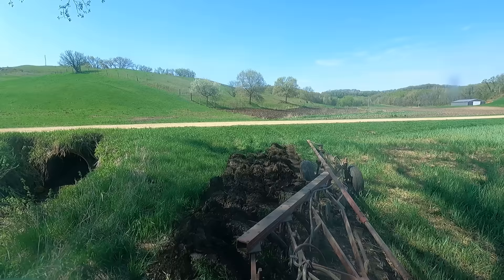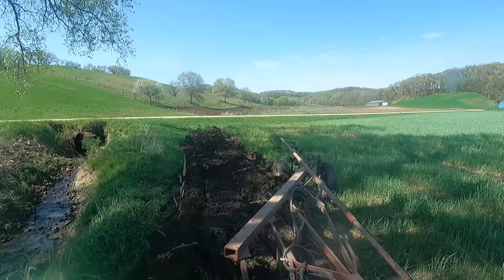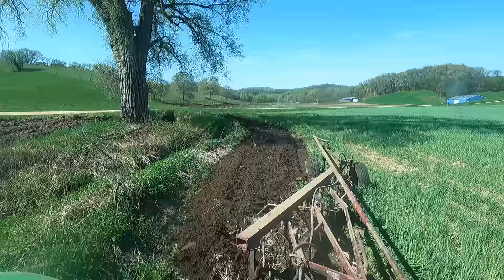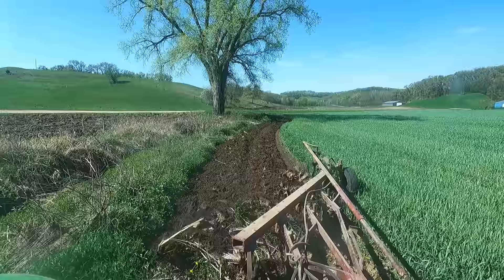On the first pass we've got to set the front part a little lower on the three-point, being that the wheel that would normally go down in a furrow is not in the furrow yet until the furrow is there. You don't want to move too fast because you don't want to throw the soil too far — you don't want to see it covering.